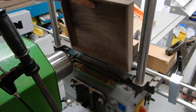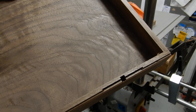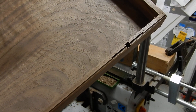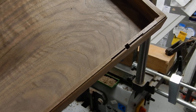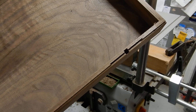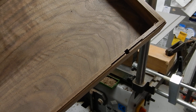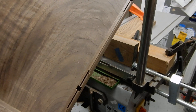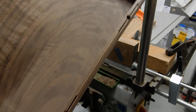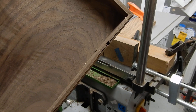We'll pull this out and you'll see what I've done. There they are. It's a critical fit — where these square holes from the hollow chisel are positioned is crucial. If one of the four holes is misaligned, you're going to have problems getting the kerf hinges inserted into the box lid and walls, and the fit will be off. I'm down to probably a sixty-fourth of an inch in positioning not only the slots but the square holes that correspond from lid to walled box. That's it — thanks for watching.